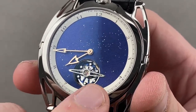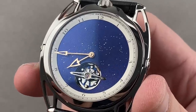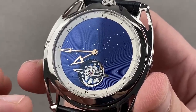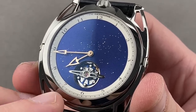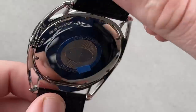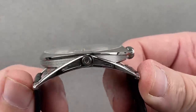This is their 2016 balanced design with white gold masses and a full titanium wheel. Denis is constantly trying to improve balance performance by moving more mass to the outer periphery and reducing its reaction to temperature changes — its thermal coefficients. We have a full black polished bridge for the balance, the hairspring mentioned before, and the silicon escape wheel. Inside this incredibly thin case, we have a manual wind six-day power reserve along with the DB28's signature floating lugs.